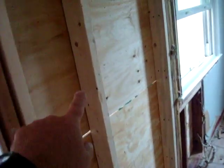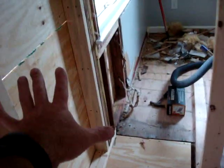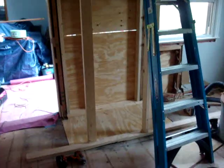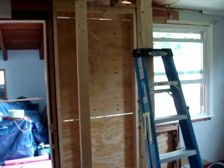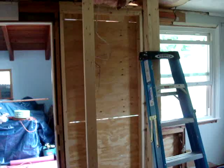With these two temporary two-by-four supports in place, we went ahead and did all the demolition on the wall. Now it's the weekend, Josh is off, and I'm here working. I already put one of the load-bearing members back in and I'm going to put the second one in — 16 inches on center, lining up with the joists. Then I'll pull the temporary wall down. That's how you fix a load-bearing wall: build a temporary load-bearing wall, support the load above, do your work, pull your temporary wall down — and life is good, after the building inspector says life is good.